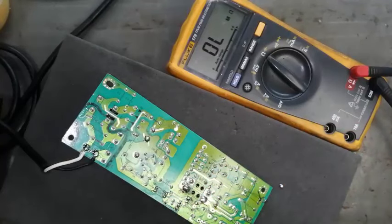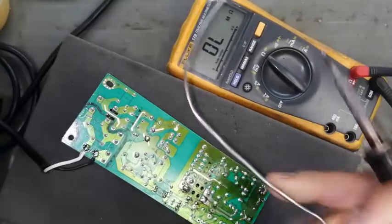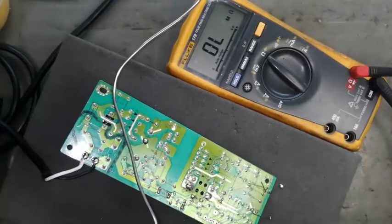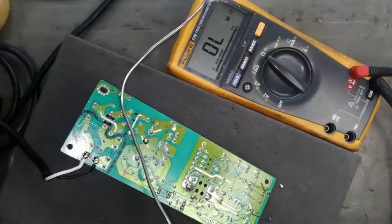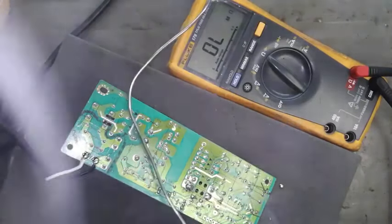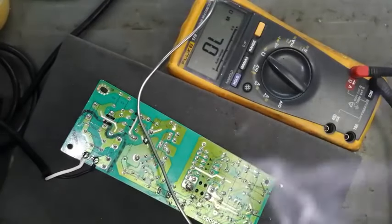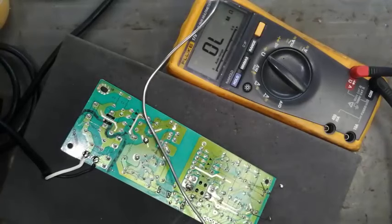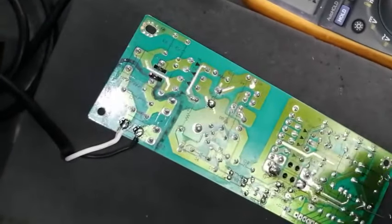Take special care: if you want to take some extra voltage, maybe sometimes you need to replace the output capacitor, because this supply is maximum 5 volt, and if you want to take a higher output, you have to replace the capacitor. The output capacitor must be replaced, otherwise the capacitor will be damaged. In this way, maybe you will find some deficiency of current, but no problem.